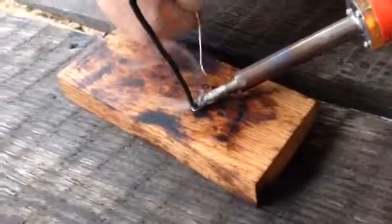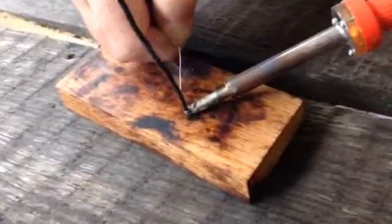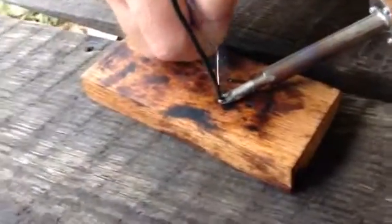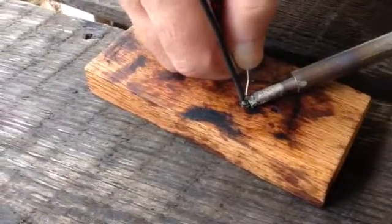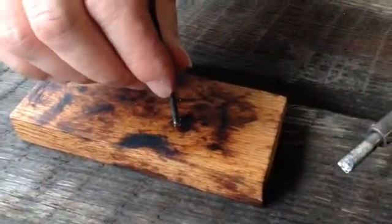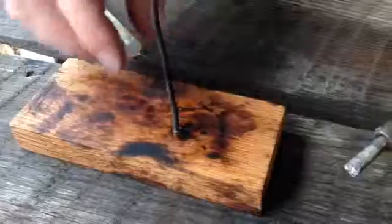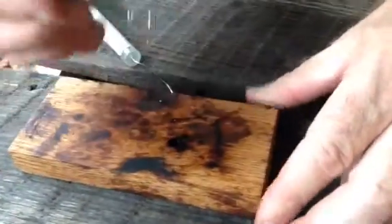It's best to have the wire pulled out a little bit, then solder. Just heat up the actual connector and then just kind of fill it up with solder as you go. Get it pretty close to the top. Just center it, center the wire, let it cool down. It'll cool down in a few seconds and then you can pull it back out.